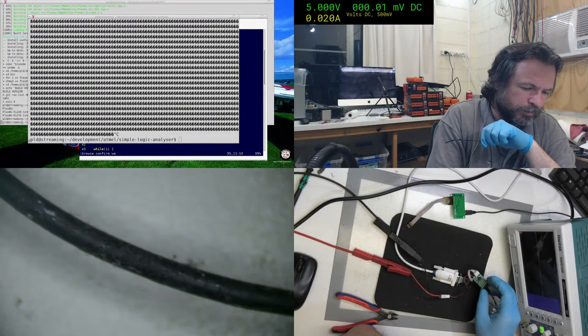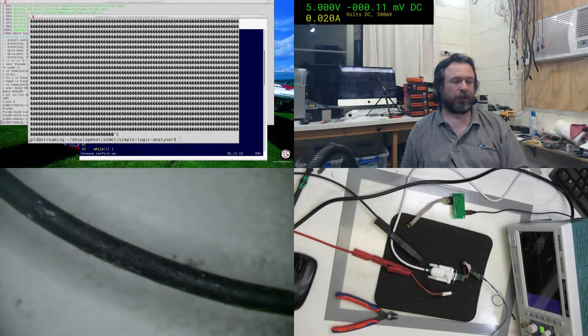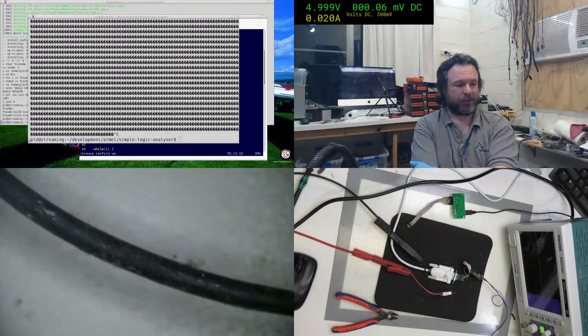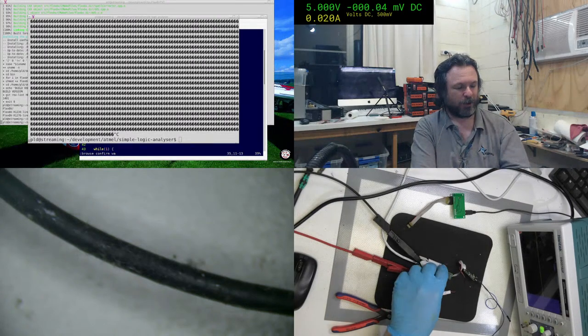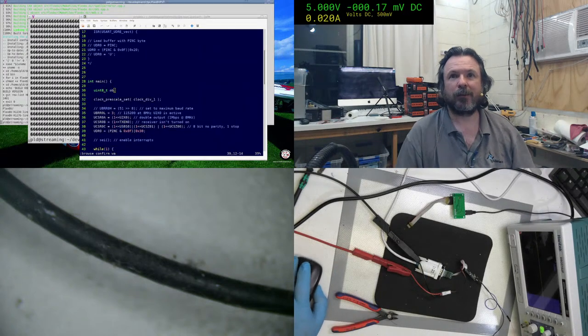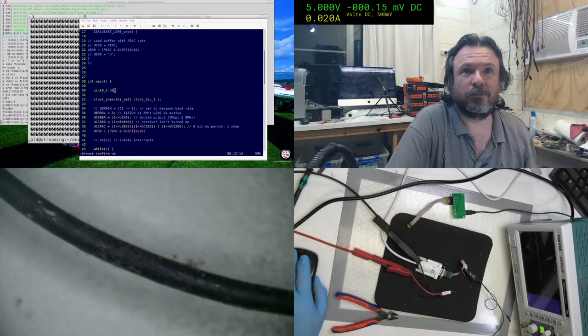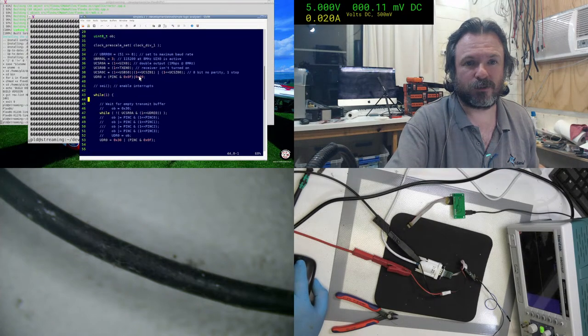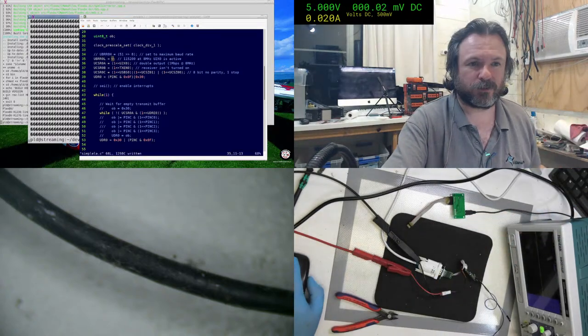That's a shame. So the actual device here can generate up to 1 megabit data output on the serial port at 8 megahertz, but I think that the bridge can't handle it, and I suspect this might not be able to either. Yeah, let's try it anyway. Let's see, 1 megabit, we've got the 2 multiplier, and we set it to just 0, so this really just runs flat out. No time for anything, just flat out.